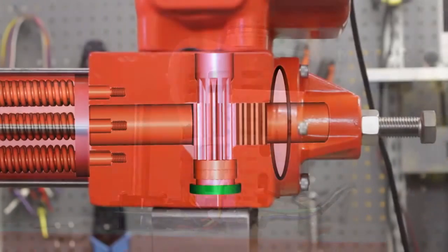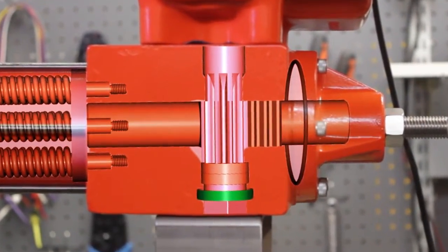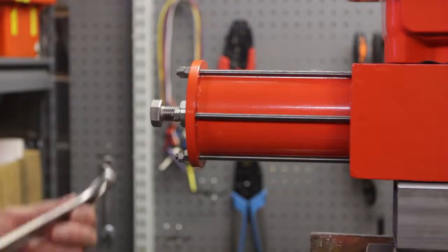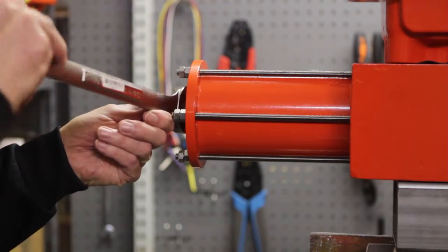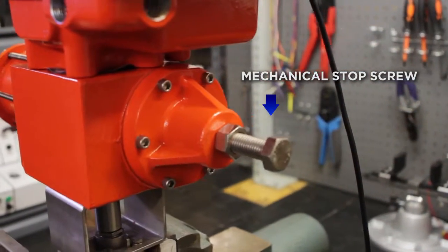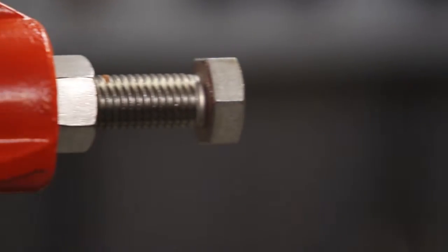The electric motor is the electrical source of power that rotates the gear to position the actuator under normal operating conditions. The spring adjusting screw is how you adjust the spring end torque of the actuator. The mechanical stop screw is where you set the fail position of the actuator.